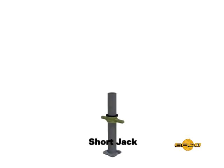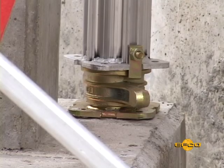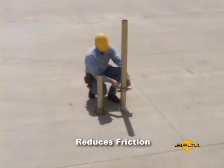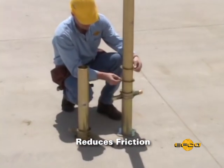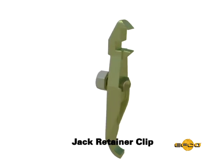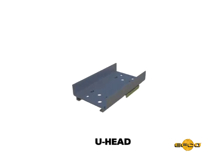There are both long and short jacks that slide into either end of the posts. They can adjust to any length between 5 and 38 inches. They are made of durable steel that can support 18 to 28,000 pounds and is thin-walled for lightweight and easy handling. The jack washer reduces the force required to release the jack wing nut. The jack retainer clips, required on each jack, come as a complete assembly and secure the screw jack to the shore line.